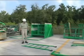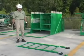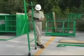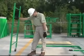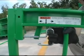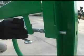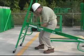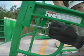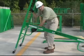Next we're going to demonstrate how to put the utility tower or baker scaffold together. First, make sure all four casters are locked — it'll make it a lot easier to stand the frame up and it won't roll away on you. Walk to the end of one of the six-foot frames and stand it up at a little angle. Take the truss assembly, stand the side frame assembly up. There's a trigger mechanism — grab and pull the pin out, it's spring loaded. Put the truss assembly on, move it up or down until the pin locks in the frame. Make sure the pin locks.